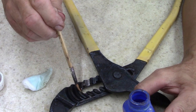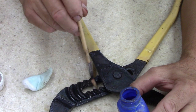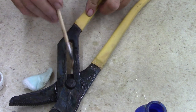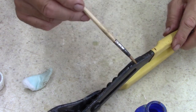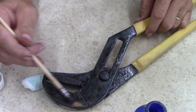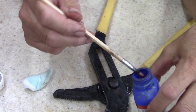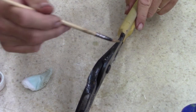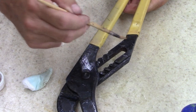Right there in that area, I ground it with the little Dremel die grinder. For some reason, there was something right there that was pitted really bad. I don't know what the chemical was on this that bound with the acid, I mean, with the rust, mud, I don't know what it was. I know it was hard to get off. I used my big wire wheel on my big grinder, and it had difficulty. When it got soft with that rust remover, it softened up and made it like a putty, which was kind of interesting.